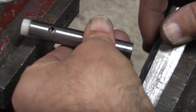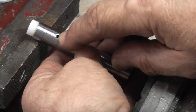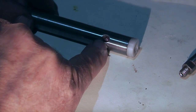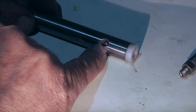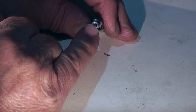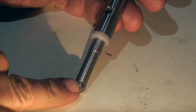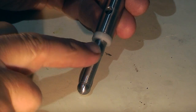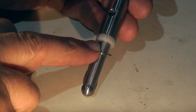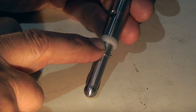You can see the LED is just lined up with the hole, and the small hole on the back is to be able to poke a cocktail stick through to push the LED forward. Now if all goes well you should have the LED in line with the hole. In the probe, when I centre drilled it I've got room there for a very small spring. So when you screw the probe into the body it should tighten up on the face. If there's a gap and it's tightened up you need to take some off the length of the probe. If it's tightened up but there's no electrical contact you can put a small spring inside to make up the gap.